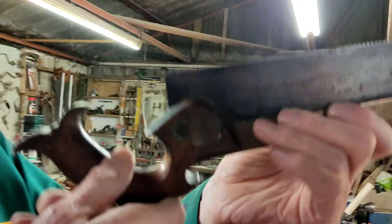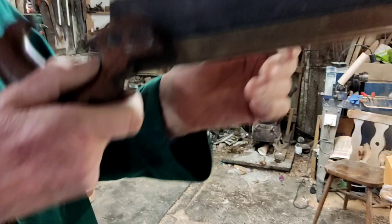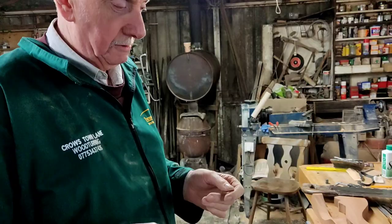But that'll need to be cleaned up. There's a wee tiny kink up here in the front, and I can fix that. But you'd be better to sharpen it up, get a bit of heat in it, and then with a wee bit of heat in it, set it and bend it a wee bit. Can you see there? There's a wee kink in it. Somebody'll try to saw something very hard in a board, and then bang it — and the board twists it.